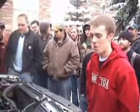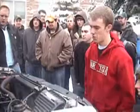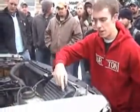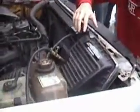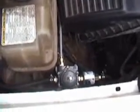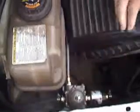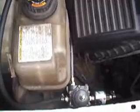This is our diesel propane, or our propane injection system to a diesel engine. It's digitally controlled. If you want to look down in here, this is where it all goes down. This here is our regulator and our solenoid, which is connected in through the transistor to the PIC, which activates at several set states whether to flow propane, and judged on the boost pressure which comes into the regulator here, it'll flow different amounts of propane into the engine.